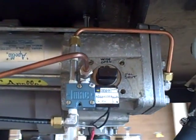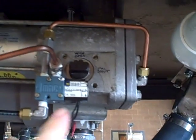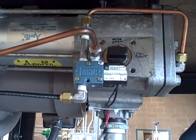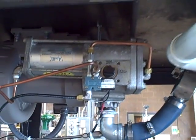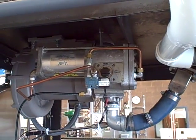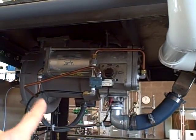You can also see the shutoff valve right here — it's a piston-actuated ball shutoff valve. We use this for emergency shutdown of the turbo, and we also keep this ball valve shut during the startup procedure until the air blower has reached close to full speed. The PLC controls the timing of the system during startup and shutdown. When we start this up, the PLC waits a certain amount of time after turning on the oil pump before it begins to energize the air fan. We want to make sure there's oil going to the turbo bearings before we turn the air fan on and open up the valve.